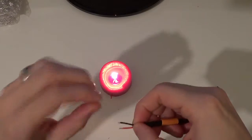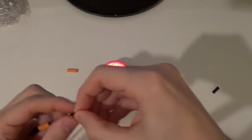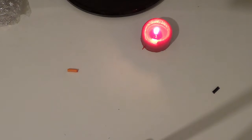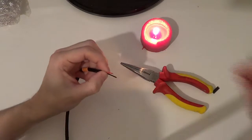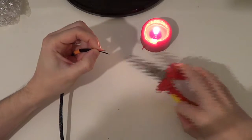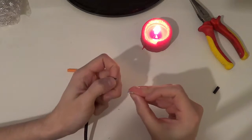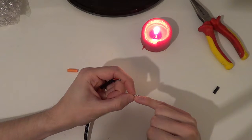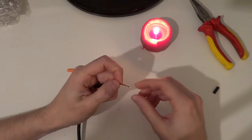I'm going to use a helping hand to do this, because I'm going to solder these slightly afterwards. I don't actually have a crimping tool to crimp round the lead connectors, so I'm going to use the next best thing - needle nose pliers. One thing you want to bear in mind with these connectors is when you crimp them, you don't want to actually get the cable right down inside. You don't want solder to get out of the channel because the connectors just won't go in, and you'll have wasted them.